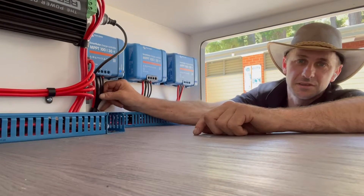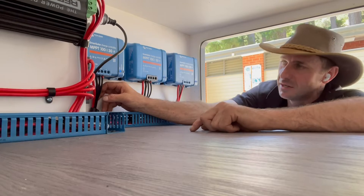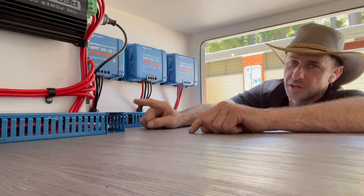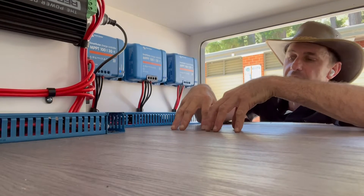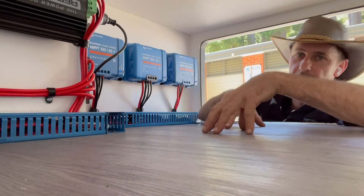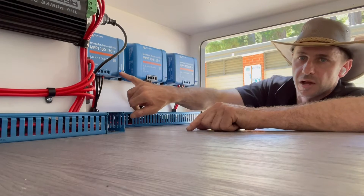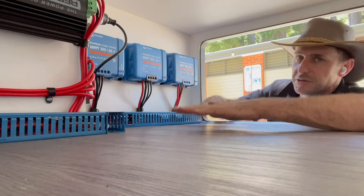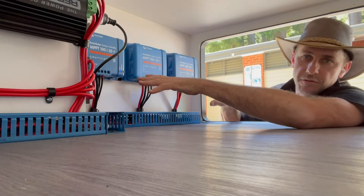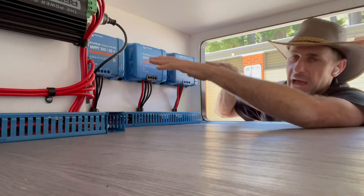On the PV side the current is very minimal — that's why we're able to transfer such high power from the roof because we run it at high voltage. You can only do it in certain setups. It's all to do with shade — if you shade one panel on a series string, you'll diminish that array. That's why we have three solar controllers, each taking care of their own little system on the roof, bringing it down to one uniform charge because these three are networked together. They're talking to each other — all in bulk mode right now — and as the battery fills up they'll all move to absorb simultaneously, and once full go to float.